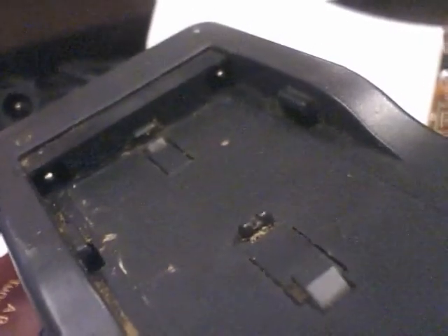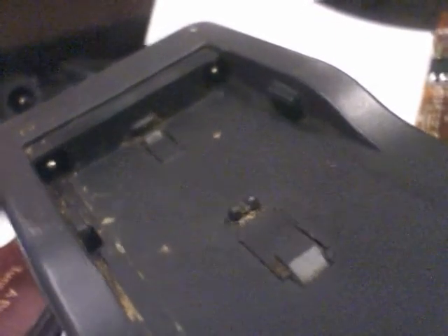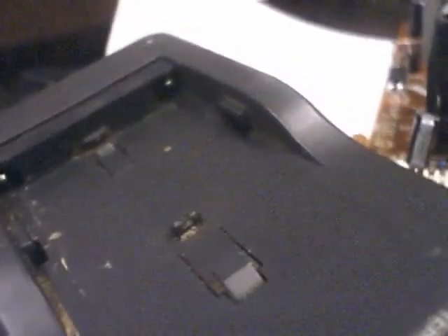This charger also does no preconditioning. So if a battery sits too long and drops below the initial charge threshold, you won't be able to charge it again. I bet a bunch of the battery packs I went through were still good but the charger couldn't charge them because the voltage had dropped below that initial threshold. The manual says when the green light comes on, time it for two hours and then you're charged. So I've got to sit there, watch for the green light, then start the clock — that's pretty lame.